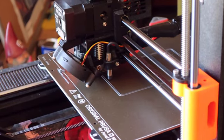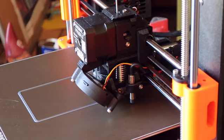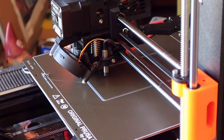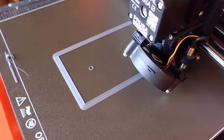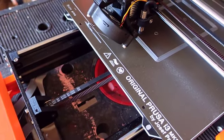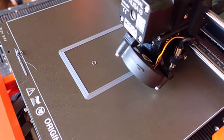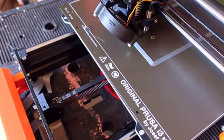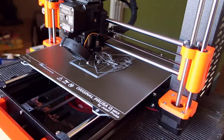According to the menu, we have 7 hours and 55 minutes remaining. One of the reasons it takes so long is that filament is coming out very thin in all dimensions — X, Y, Z — and it's putting down layer after layer, but it has to get the first layer complete before it can start the second layer. It's interesting to see; you can observe in the development software the order that it's going to do these layers in. This is a switch plate — those two holes are the screw holes that will hold the switch plate to the switch box.